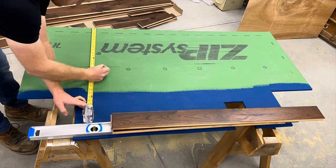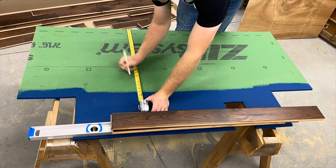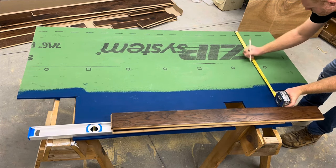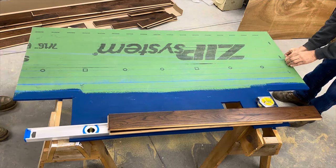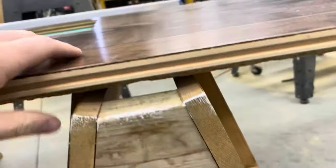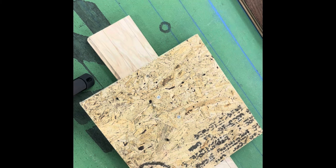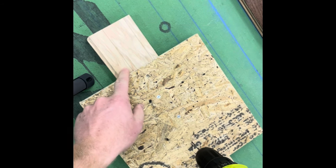To start the next day, I began making marks all along the plywood to give me some straight lines to reference. I used my tape measure and measured down from my straight edge every few inches from where I wanted to start my first row of hardwood flooring. I used a chalk line to make straight lines, but a straight edge and pencil would work fine. I laid out some pieces of hardwood flooring to see how many rows I would need to get the overlap correct on top. You can see the hardwood floor will extend past the plywood on the top, creating the reveal I want. I'll drill from the bottom up into the flooring — not too deep, you don't want to poke through it — then take my screw and screw it in so the flooring is attached.